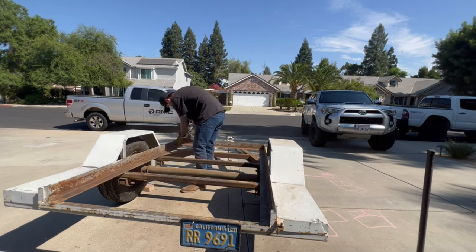To get a better idea of what I was talking about, now everything is flush, so when I lay that plate on top, I'm not gonna have any weird gaps. Flush all the way around. So now all I have to do is get the sheet sheared from my local distributor. They charge $1 per cut, so that's not too bad. Saves me going through a bunch of cutoff discs because I don't have a plasma cutter. That's next on the list to buy, but first, let's get the rig built.